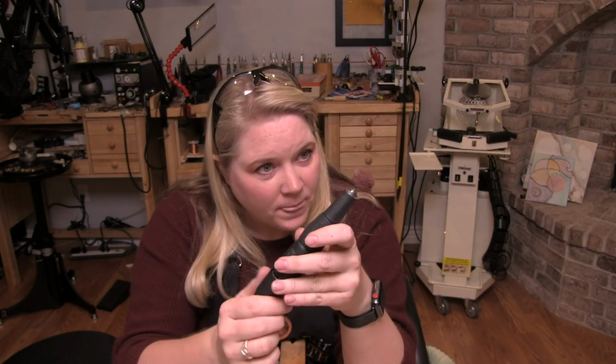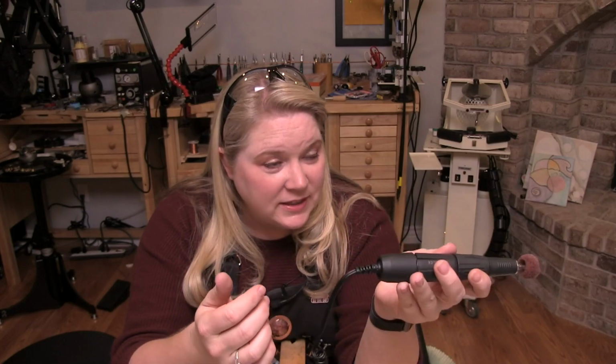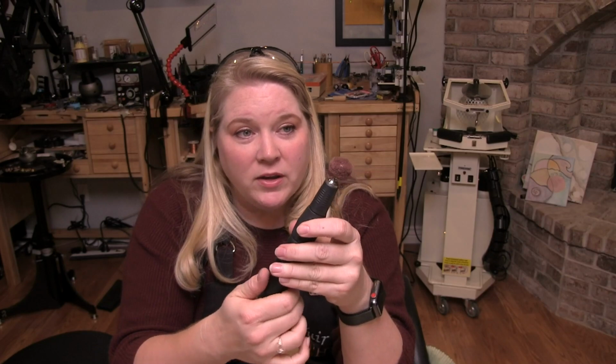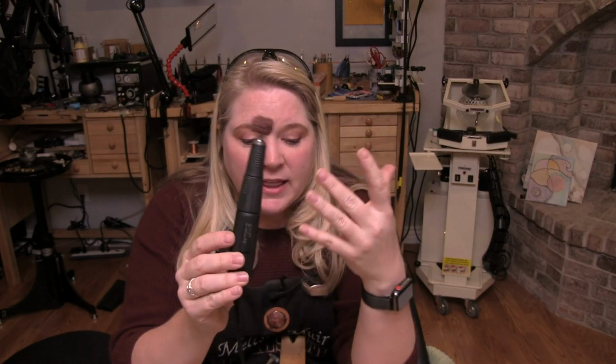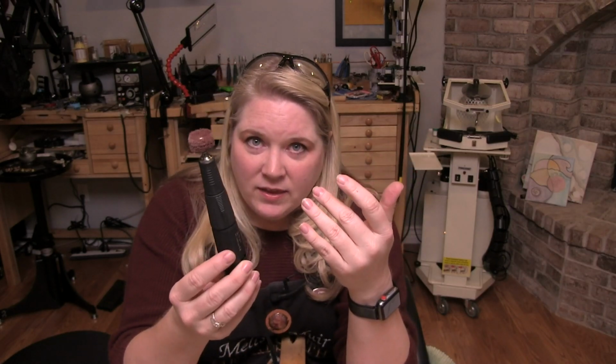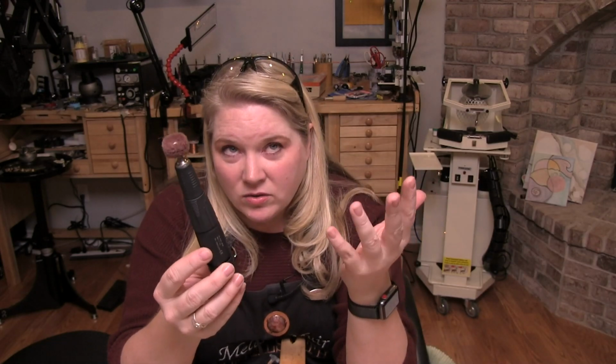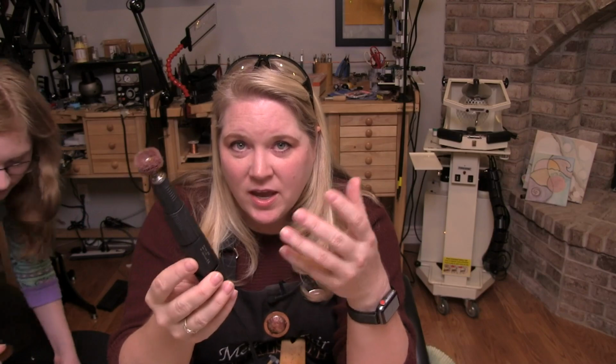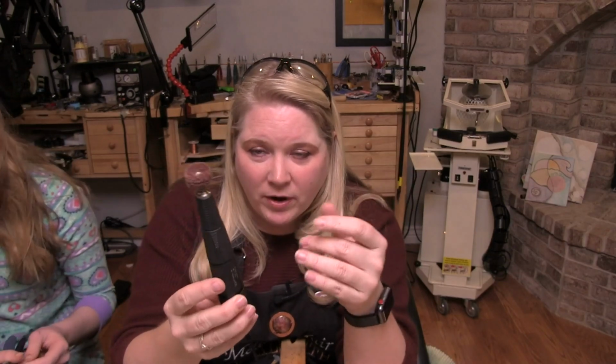So why are the brushes right there, though? Well, so you can easily get to them. So in this case, they're not too difficult to get to, but you do have a little bit more maintenance. Now this micromotor, it depends on, you can order the brush type motors in a couple different configurations, and when you do that, it changes what the part number is.